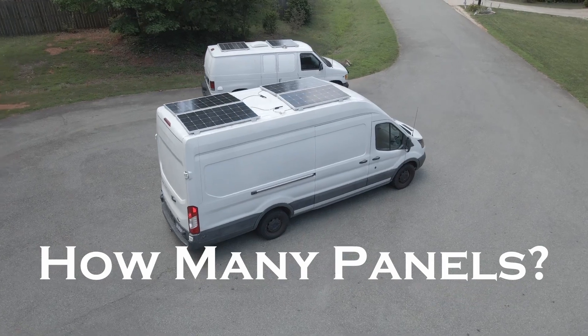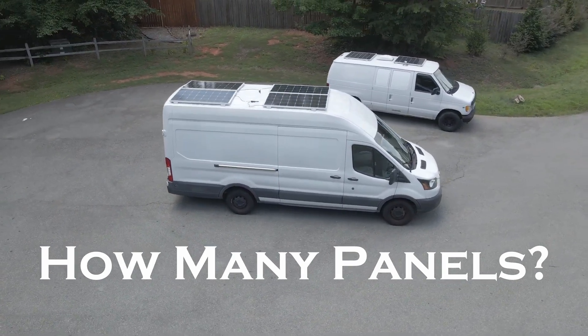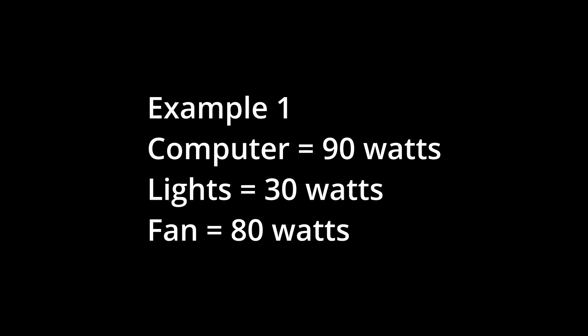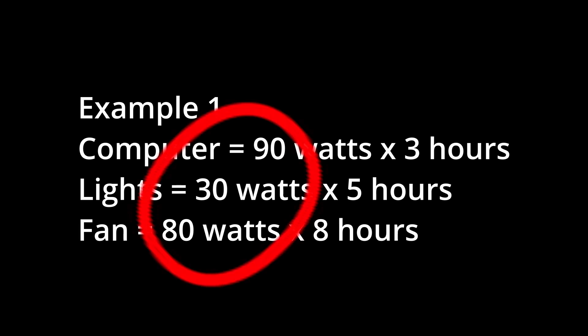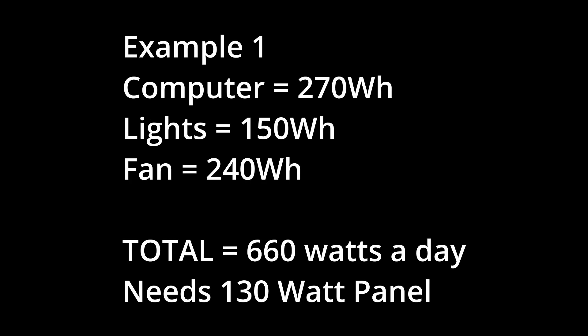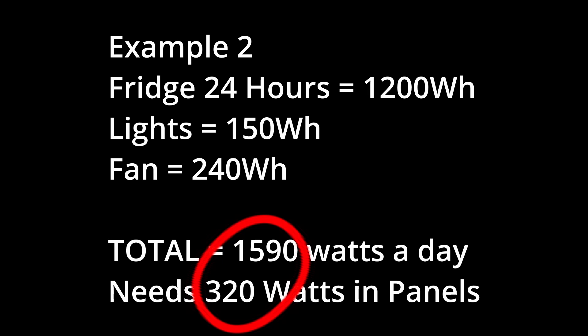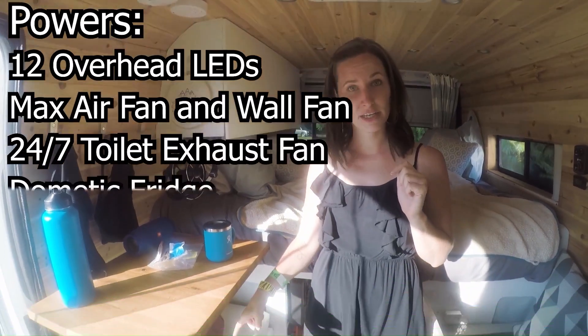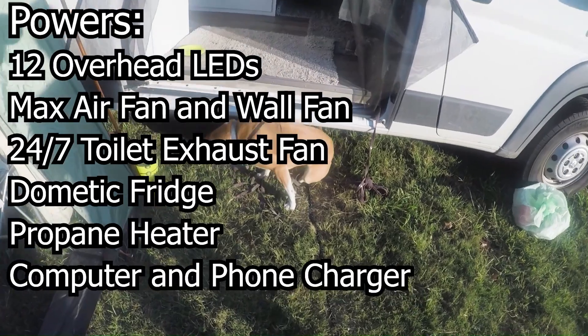How many panels do you need? First measure what will actually fit on your roof. Look at the labels of each appliance you'll be using to find their watt rating, determine how long in hours you use each device per day, then multiply power draw by usage time to get watt-hours. Size your panel system accordingly — if you use 1000 watt-hours a day you need at least a 200 watt panel; if you use 5000 watt-hours a day you need at least 1000 watts of panels. This is averaged out assuming about five hours of good sunlight per day. If you want real-world examples, watch my first electronics video where I give about 10 different scenarios you can copy.